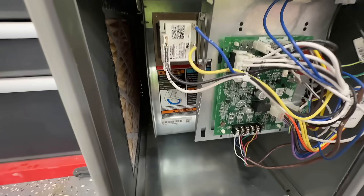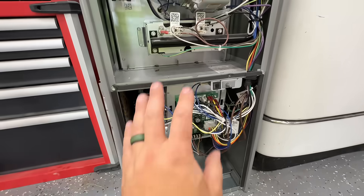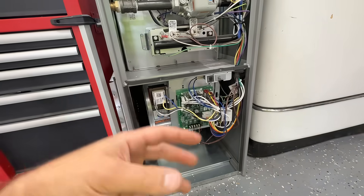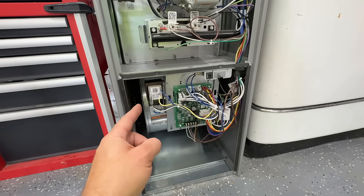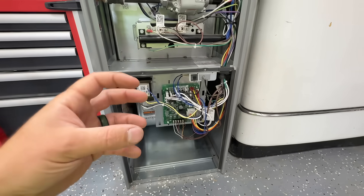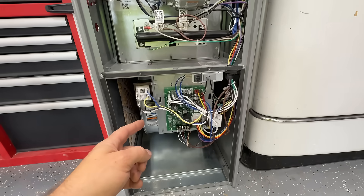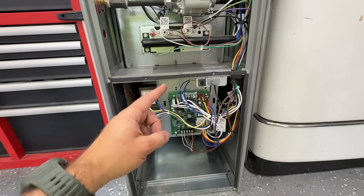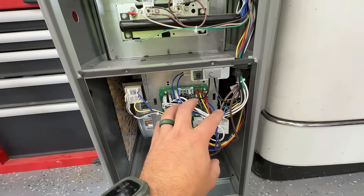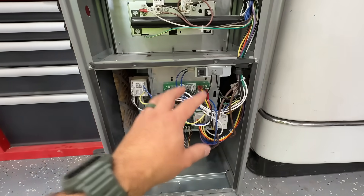As a bonus for tip three — make sure your power is off before putting your hands in here; there's also an interlock switch to ensure no power gets through. You can reach in where the fan blade is and spin it: if that blower fan wheel is not spinning freely, that could mean your blower motor is bad. A lot of times if the blower motor is trying to go you'll hear a buzz, which is also a good indicator it's bad. Also note that many furnaces have a capacitor inside for the fan motor, so if the motor isn't spinning freely, check that capacitor as well.